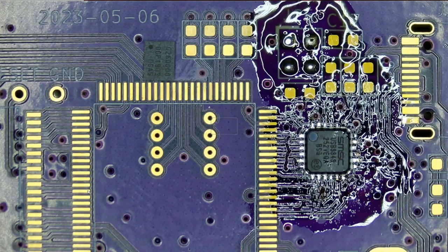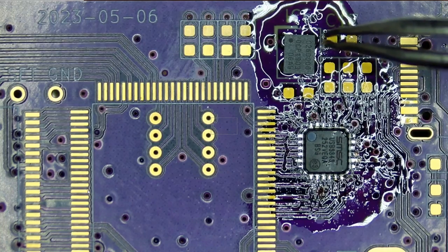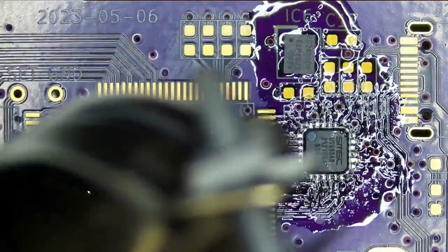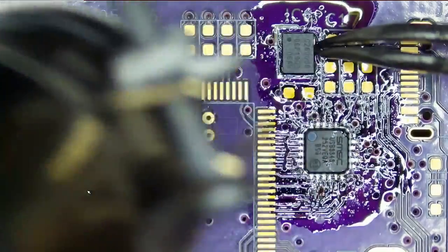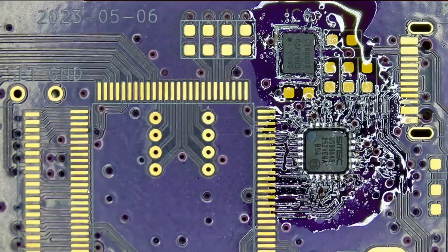Now let's work on the crystals slash oscillators. I'm going to add a little more flux and then put the oscillator in place right on those little blobs of solder I put on the pads. These are really tiny, so it's a little bit harder than it looks to place them. The flux is also sticky, which means if you get it on your tweezers they kind of try to stick to the chip. Same process — heat it up on the preheater, and as soon as everything's good you'll see the chip wiggle a little just from the air. Right there, it kind of popped into place, and every time I tap it, it pops right back where it should be — at that point I know I'm good to go. Gradually take the heat away and that chip's soldered.